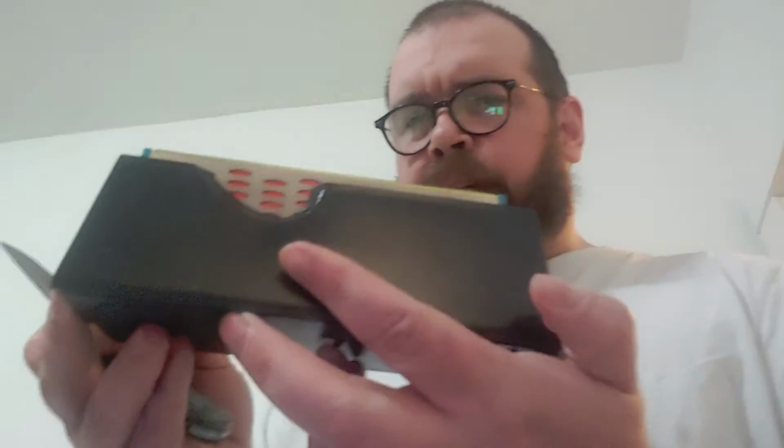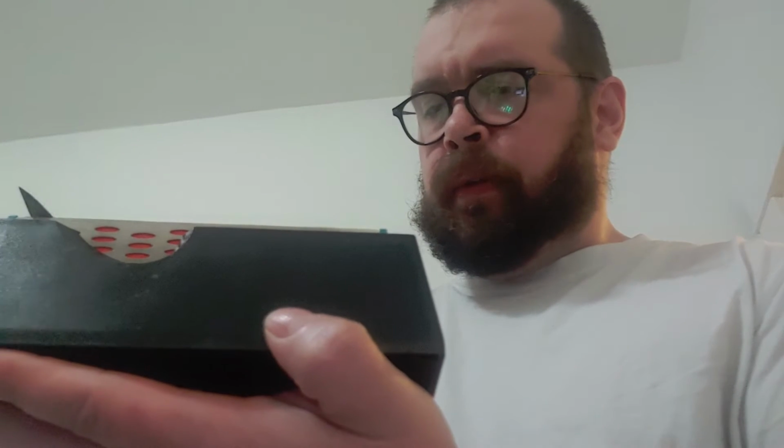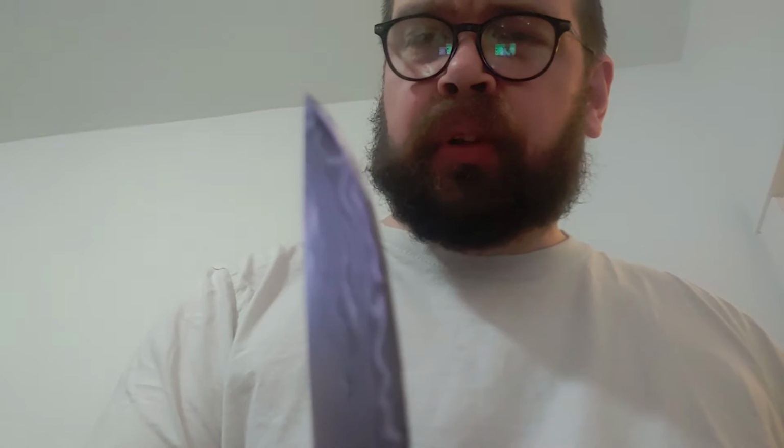So what you want to do, you get your knife, you get it marked. You've already oiled your stone. And what you want to do is you want to take it, get about the right angle, make a couple strokes, and then check it. Now see, that's pretty well got the right edge. But you see, if you can tell, there's a few low spots.